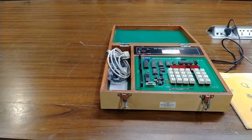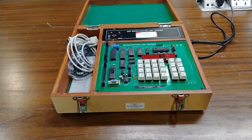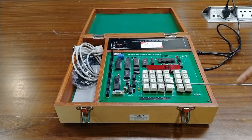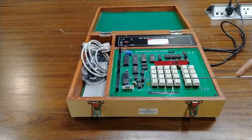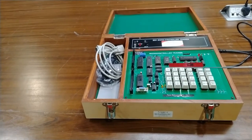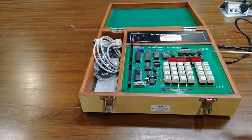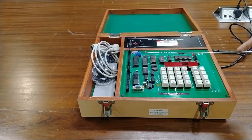Now I will explain some of the important components installed on this PCB. We start with the CPU, which is the 8031 microcontroller running at 12 MHz frequency. For memory, we are using 32 KB EPROMs, 32 KB RAM, and 2 KB NV RAM. Battery backup for RAM is provided from 3.6V lithium-ion batteries.